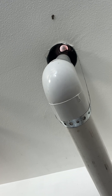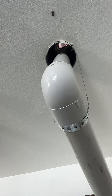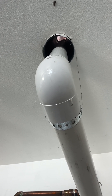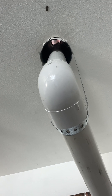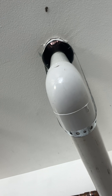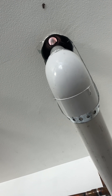When they built this place, the single-wall tin pipe was the wrong material. I don't even know how it passed inspection originally, because at a bare minimum it should have been a dual-wall B-vent to go up and terminate through the roof.